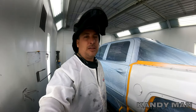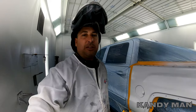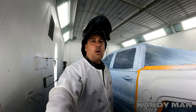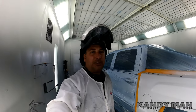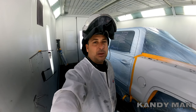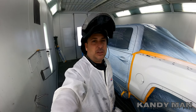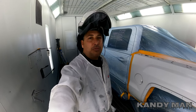All right guys, that's coat two. I know I said I was using a 3M gun, but I forgot — I've been using the old Techniclear coat gun for all my whites, because I had that gun designated from before when I didn't have all those 3M guns. I like the way it works really well. It puts out a nice amount of material for the white, and we don't have to worry about blotch or anything with these white ones. The whites seem to be thicker in any of the waterbase that I've ever sprayed through the years, so I'm using this one. Take those words back for the 3M gun.